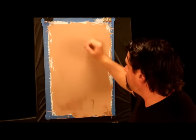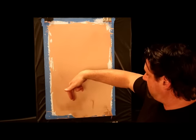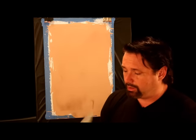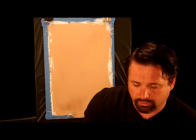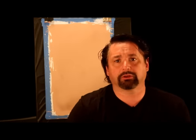We're ready to move on - this is 100% dry and the color looks like warm beach sand. That's the color we're going for. If you have a hard time finding the Chocolate Raspberry colorant from Modern Masters, remember - warm beach sand. I'll also show the difference between wet and dry areas here; you can see the discoloration, the difference between the two colors. Dry samples - very, very important. Now we're going to bring some new things in - this is a plaster hawk, get them at any paint store. I use ones with rubber handles. And a natural wool sea sponge.